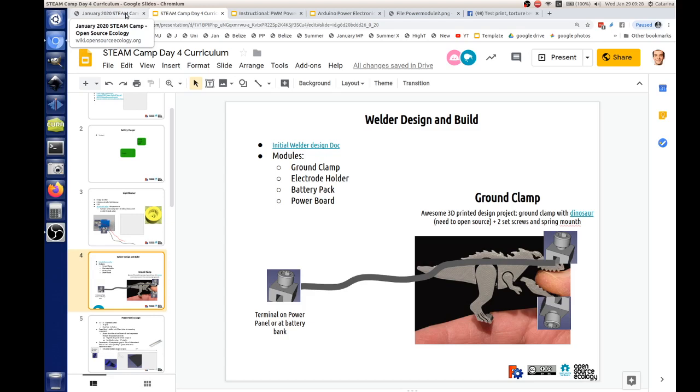You've got this little power pack, well, that's called the battery already. And then using a small electrode, like 1/16 inch, the very tiny welding sticks, welding rods, they only require like 20 amps. And that's well within what the little 18650 cells can do. So we'll do this little 1 pound portable welder. And that can get you about 5 minutes of welding before you drain the batteries.